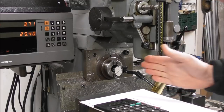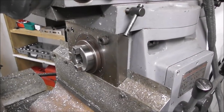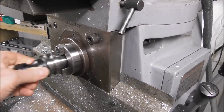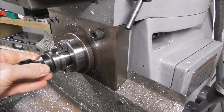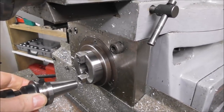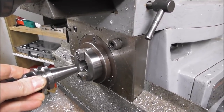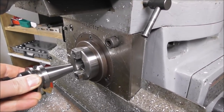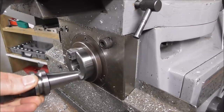You can check to see that you have the correct taper in your machine, because the actual taper really matters. You don't want an error in your internal machine taper or on your holder cutter-holder taper — it's got to be a very accurate match. This is what makes it expensive. The internal taper is ground with a very small internal grinding wheel, which is very easy to get wrong and very difficult to get right. The grinding wheel needs to be accurately dressed and on center, and even externally grinding the mass-produced cutter holder tapers is easy to get wrong.